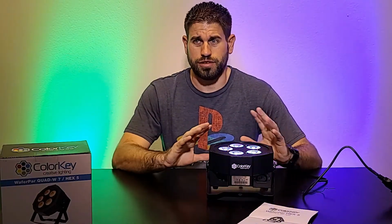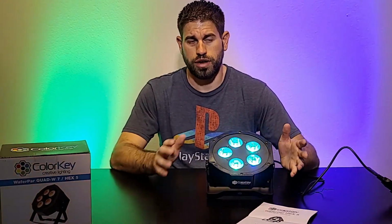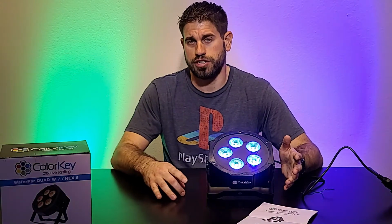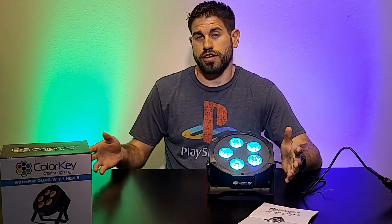Because with Sound Active and Master Slave, these things kind of do what they want. There's no brightness control for Sound Active and Master Slave. You just deploy it and it does what it wants to do. But with DMXing, you can tell it what you want it to do, whatever color, when, and also how bright you want every scene to be. You have full control, whether you just want individual control over each color in the 6-channel mode, or the full 10-channel mode where you have all 6 colors of control plus the master dimmer, plus all the other controls of strobing and other macros.